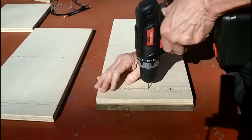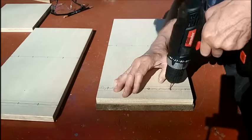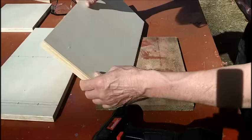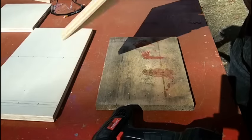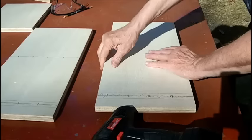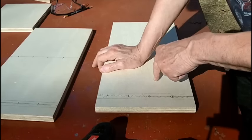See? The holes are nice and clean. If I hadn't put that board underneath and drilled through, you'd have wood splintering out on the finished side — so it's important. When I bang the nails in, I'll use wood filler, sand it, and paint it. We're not going to stain it and get fussy — unless I can find a combination stain. It has to be like a light oak to match the furniture he's got in his room, or maybe brown paint.